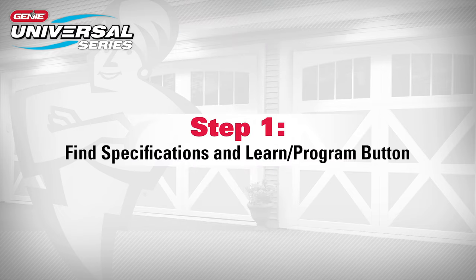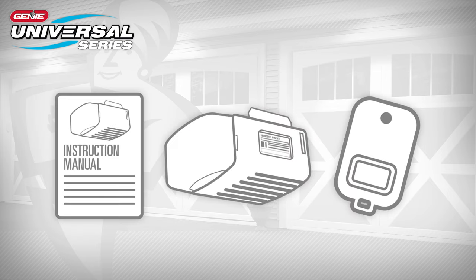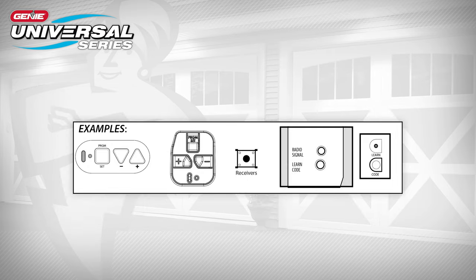Step 1. Find specifications and learn program button. First, locate the brand and specifications for your opener by checking the label, instruction manual, or current remote. Next, locate and identify the programming or learn code button on your garage door opener.